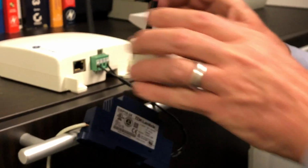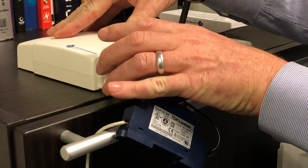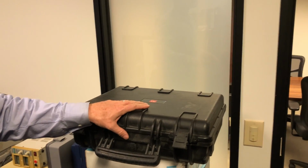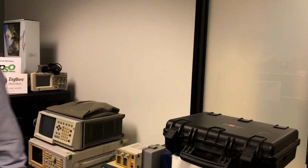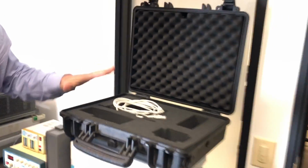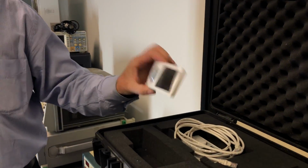So first thing you want to do is power up the area controller. It takes about 2 minutes for it to power up and be ready. Before you have done that, we have the case, and we put the occupancy sensor inside the case to keep it from being false tripped until we want to trip it. So while that's put away, you power up your controller, you wait 2 minutes, and the first thing you're going to do is basically actuate the system by letting the sensor pick up your body heat. So now you can see that this is coming on.